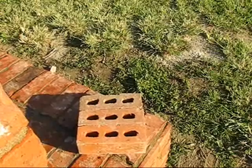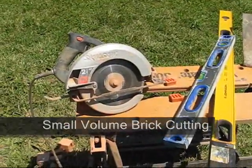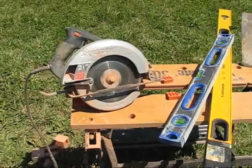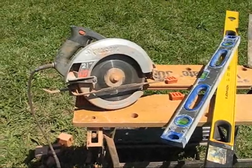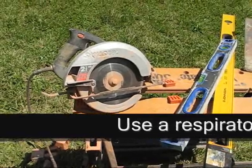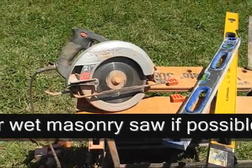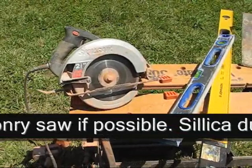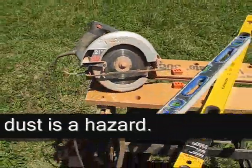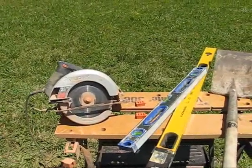What I used to cut with was a cheap dry saw — and I do mean cheap, because the dust gets in the motor and ruins the bearings. Sometimes with hardy board you'll see that too. But if you're only going to use it once or twice it won't hurt — just get a cheap saw, expect to lose it, and use one of these little masonry dry saw blades. Do it in the open, use a mask, and work with the wind blowing dust away from your house — hopefully not toward your neighbors.